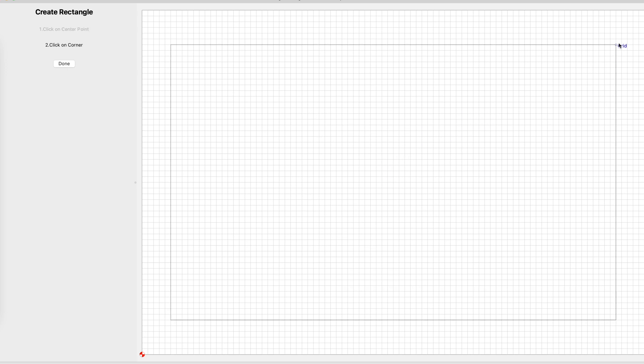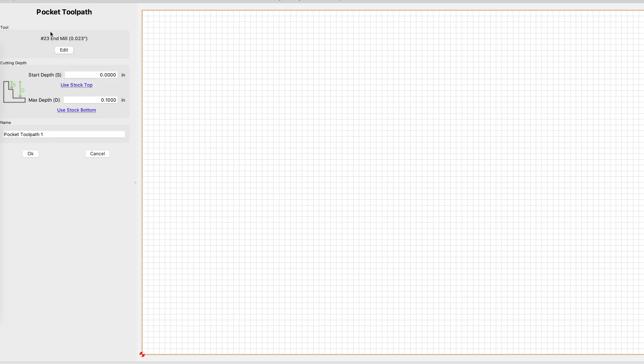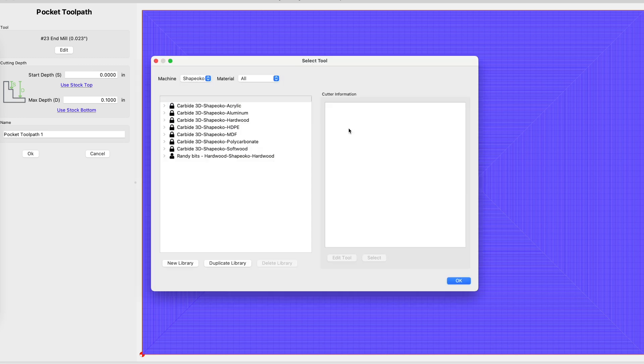The next thing we want to do is draw a square that has the same exact size as our blank. There isn't an option within Carbide Create to erase mistakes, but what we're going to do is just surface the entire area of the blank. Making the square 22 by 15 will give us a way to tell the computer to take the spoilboard bit and resurface across the entire area. Once we have our square in place, we go to the toolpaths menu and select Pocket, making sure we pick the correct end mill — in this case, the one-inch spoilboard bit.